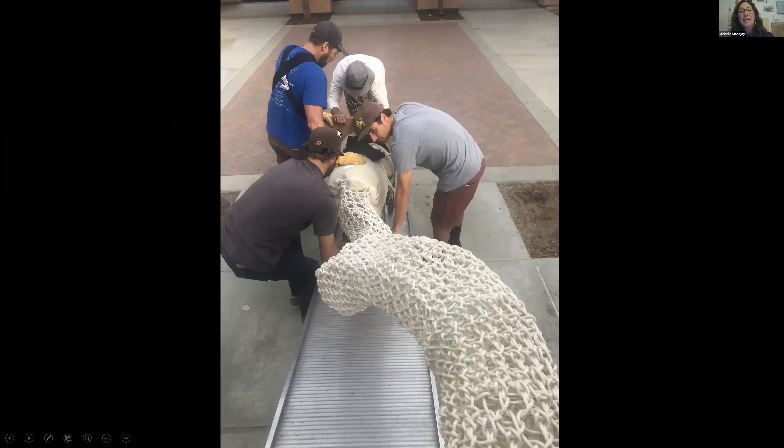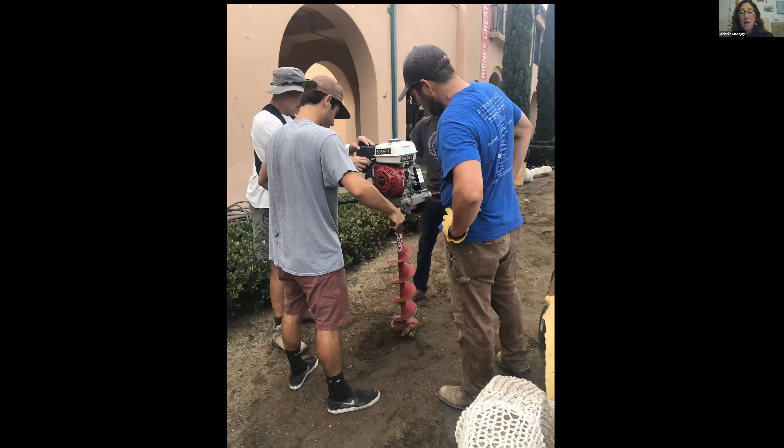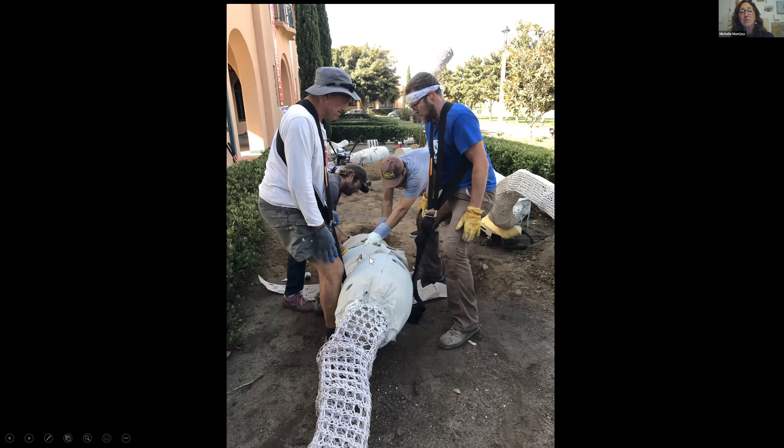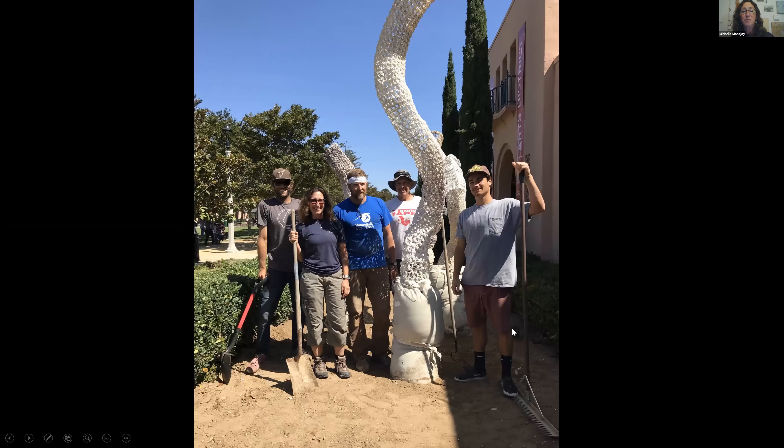Tim Penny, Kevin, Max, and Bill were the wonderful crew that day. We started around seven o'clock in the morning. We used a post hole digger to dig the holes — a very simple, old school way. The bases got attached with threaded rods and anchor bolts. Then we would roll them off and lift them up. Bill doesn't like this picture — I think it blew out his back at this point. We lifted them up with shoulder dollies, basically tipping them into the holes. And we were all done by 11 or 11:30 — it went surprisingly well and smoothly.